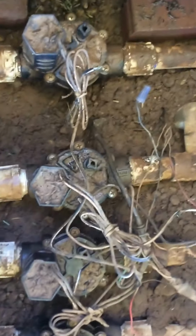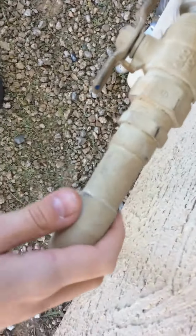This is the main valve box, water supply. This one's bigger. It has 4 valves in it. These are also current valves. They may take several different forms. You've got brass piping here, steel. That might be older. Typically nowadays they use PVC or sometimes copper.